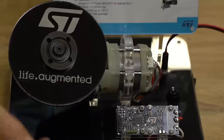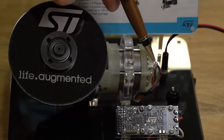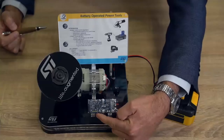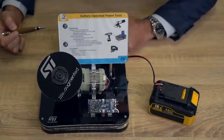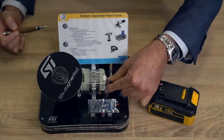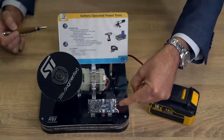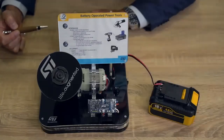The battery is connected to the board by soldering the wires to J1 and J2. Then connect the hall sensor providing the position feedback of the motor to the J7 strip on the board. Motor phases must be soldered to J4, J5 and J6 connectors, taking care of the phase sequence. Last step: connect the start-stop button.